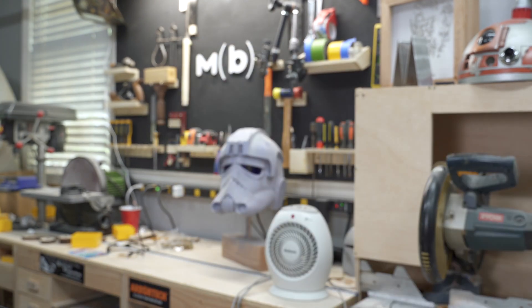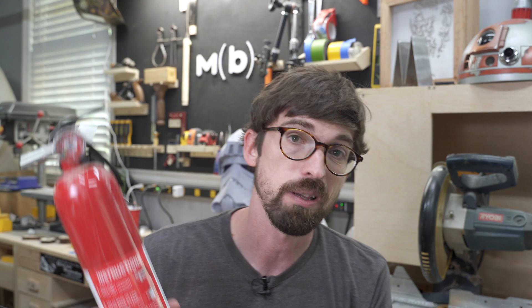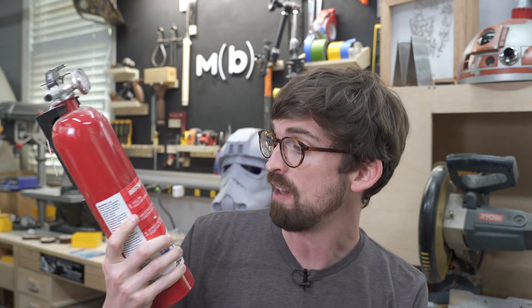What I would probably recommend, if I was going to use this permanently in my shop, is to build an enclosure around it. They do provide some safety glasses — it's kind of like the principle of looking into the sun, you don't want to do it. You're going to want some type of lens that's actually reducing the amount of light. With safety, I would also highly recommend having a fire extinguisher around — they're pretty cheap, you can pick them up on Amazon. Because there's no enclosure, there's no venting, which means working with plastics like acrylic is going to smell really, really bad. So you want to do this in an open-air environment.